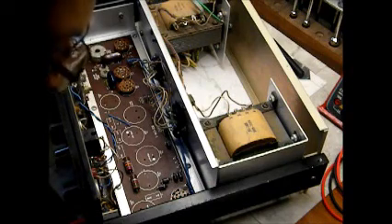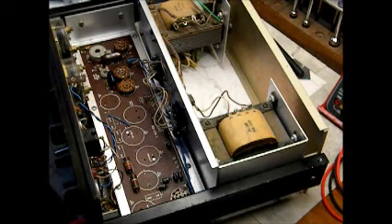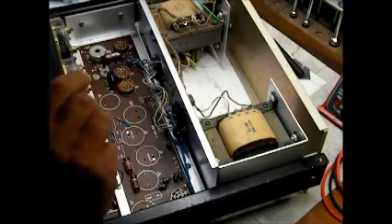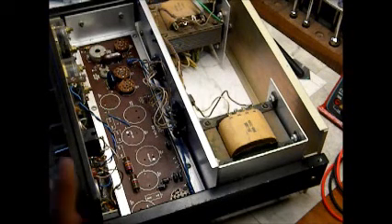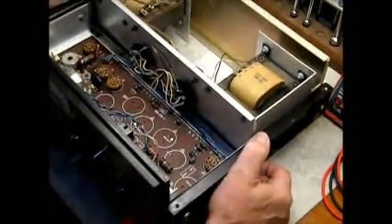I don't want to bore you watching me take this stupid thing apart. Anyway, I've already been in here and looked it over — everything seems to be pretty good. I also just ordered a tube tester on eBay today, won it at a pretty good price. I pulled all the tubes out of this thing, cleaned them up, straightened the pins, and scraped the pins to clean any corrosion off. Once I get this recapped, put all the resistors back in, and get the binding posts replaced, I'll fire it up, do an alignment, and see if it needs any adjustments.